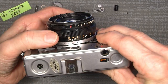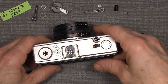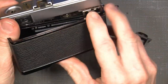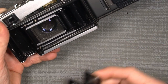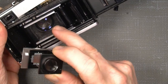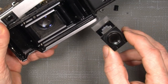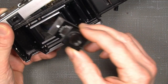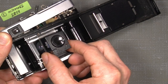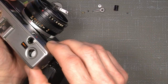If I set my focusing to, for example, 1 meter, which is based on the distance in this video, and then open the film back and have a look where to put this little tool. One could also set a piece of matte tape on the back, and then use a loupe, something just like this tool. Simply put it on here and then we have the correct distance to the film plane and we can actually see through the lens with this one.